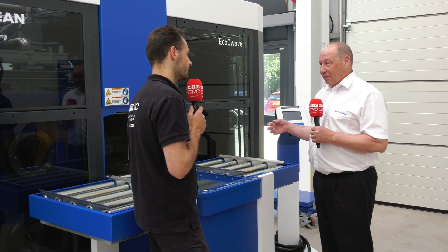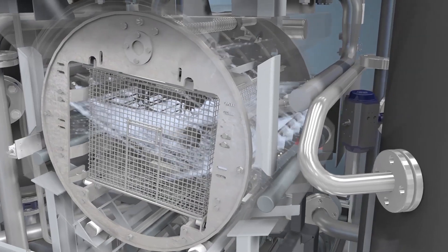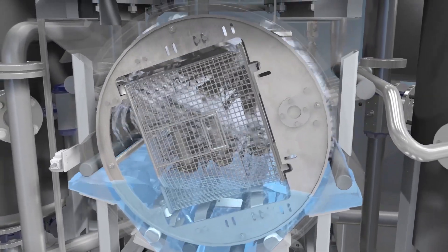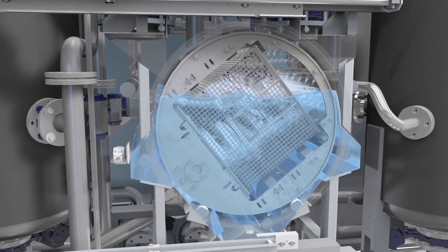With any water system you have to maintain the quality of your water, otherwise when you add contamination your quality will reduce very quickly. This Wave machine has got three tanks with a high distillation rate and a high filtration rate, which means you hold the quality for longer before you have to do something with it. Because you can't clean a part with dirty water. Exactly — smaller systems with only spray or limited power may not reach the degrease level, cleaning standards, or particle filtration levels.